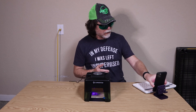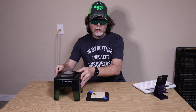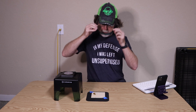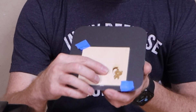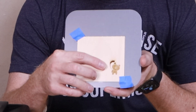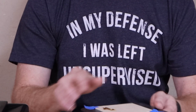Okay, it's done. For safety I'll remove power from the unit and move it off of the grid, then take off the goggles. The 70% looks really dark — you can see some darkening around the image from the smoke it was producing. The 40% looks a lot better; I think I'll stick with that for this particular material.